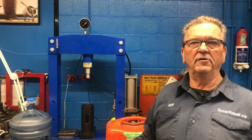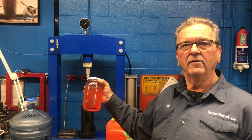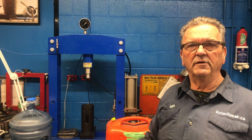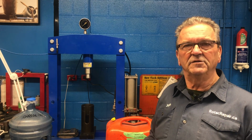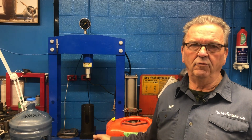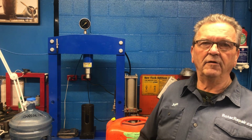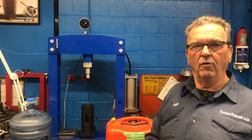I just really want to get home the point that it will only hold so much water, and then it's super saturated, and the water falls out of suspension. So if you do your fuel sample and you see 1 drop of water in there, as far as I'm concerned, all of the E10 in your aircraft is contaminated, and you need to drain it out. Then put in fresh, and I would flush it through the system right to the carburetors to make sure. In fact, I would take the bowls off the carburetors and let it flush right through to make sure that it's all gone and there's no water in there.